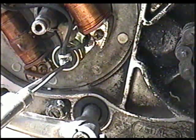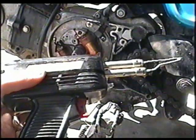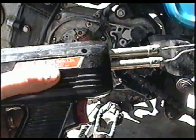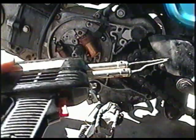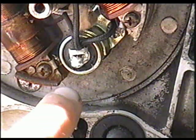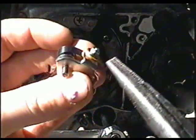You might want to wear safety glasses doing this. If you're having a hard time, give your soldering gun a break — this one says use it for one minute and give it a four-minute break, because if you keep going you can burn it out. I've got it all soldered and it's far away from the exterior of the condenser, and all the wires are tight.